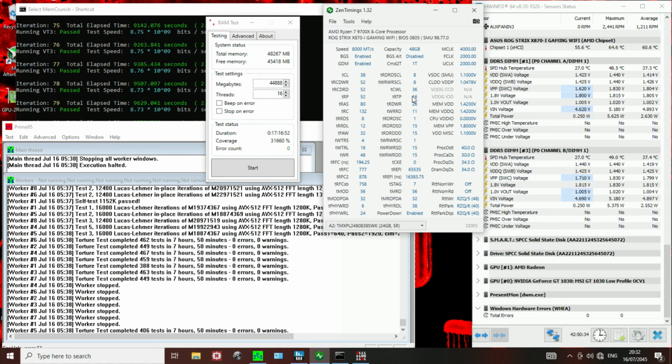Hardware Unboxed did a video where they tested the max memory speed on a whole bunch of boards. What's super weird to me is that in their testing, a bunch of ASUS boards that share a memory topology are getting completely different results in terms of stability, which doesn't make any sense, because in theory those boards should all behave the same. They have the same memory topology. Why are some of them so much worse than others? And the weirdest part about their results is it's not even the cheapest board with that topology that's the worst. That one's actually one of the good ones.